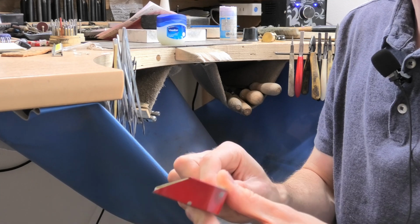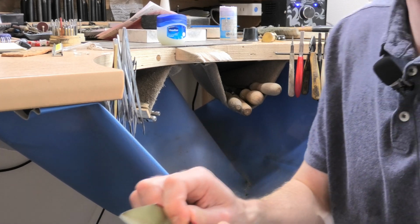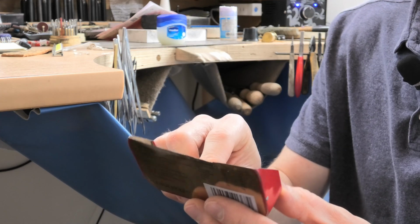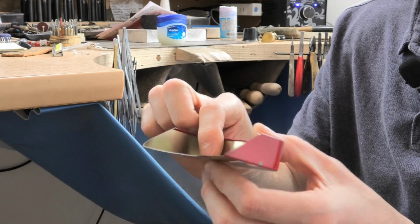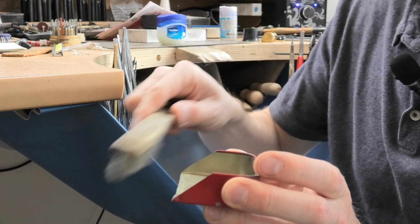Next nugget, for sweeping up lemel out of your bench skin or bench tin, whatever you've got. You don't need any fancy specially bought equipment. This was an old mint tin. I just cut the corners off, cut it across there, nice sharp edge, so it lays down really flat, and you can sweep all your lemel into it.